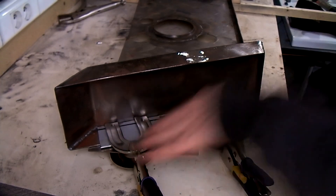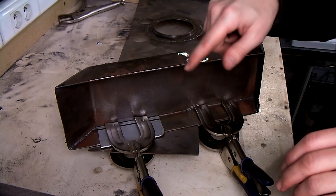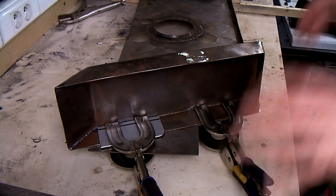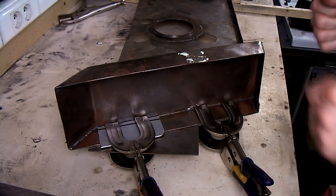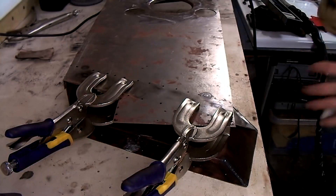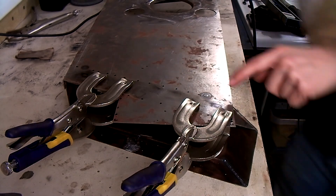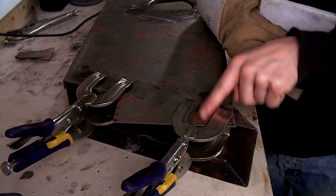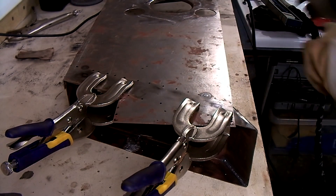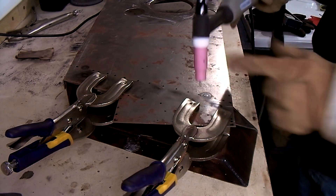You can only do this if both plates are really close together and really touching. If they're not touching you'll just blow a hole in the top plate. I'm using clamps hoping they'll give me enough clamping power to get all the plates close enough together to spot weld. If I notice I'm going to blow a hole in the plate I'll stop, drill a hole in the top plate, and do a plug weld. But if I can use this method everything will go a lot quicker because I don't have to drill all the holes. I'm not using a gas lens on my TIG torch because if it blows up it will ruin my gas lens, so I'm just using a number 6 nozzle with no filler wire.